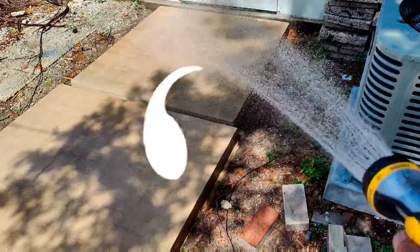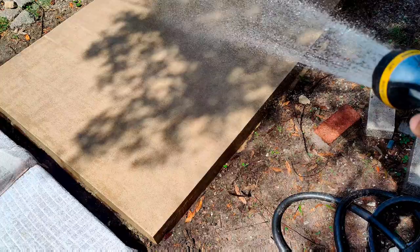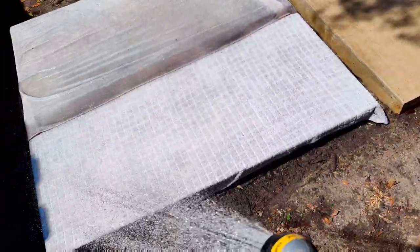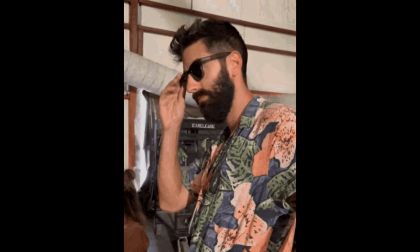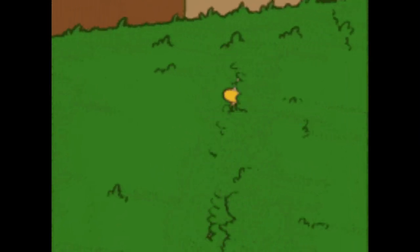I haven't put any rebar or anything in these. These are just going to get walked on — three and a half inches, two by fours. They're still looking good, still curing, steady watering. Still got the burlap method deal going on. My next video should be coming out tonight or maybe tomorrow. Peace.